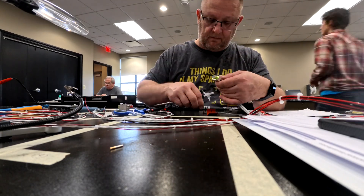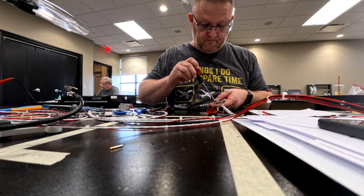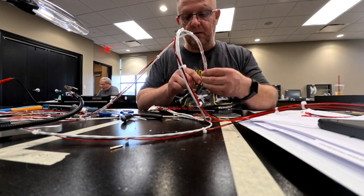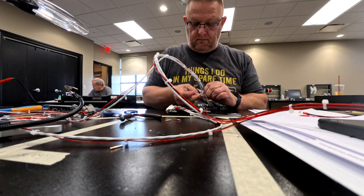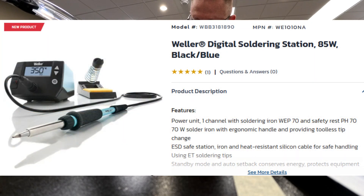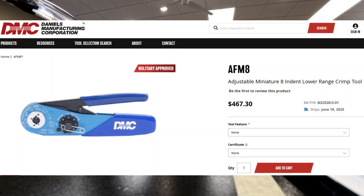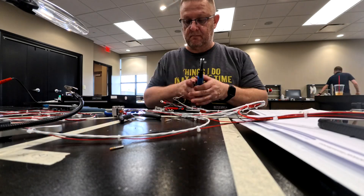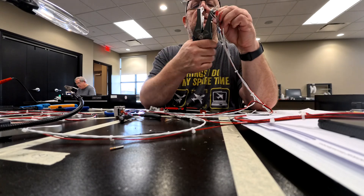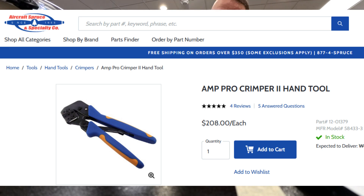You'll need sharp razor blades for pulling back shielded wires and cutting the plastic off. A heat gun with a wire attachment — heat guns are pretty cheap, but finding the wire attachment piece is a bit more difficult; I'll show some images. A soldering iron with 60/40 rosin core solder. For specialty tools, a D-sub crimper — they recommend the DMC AFM8. There are generic ones like the J-Redy ones. They also recommend an insulated terminal crimper — the AMP Pro Crimper 2.